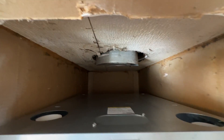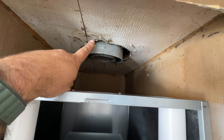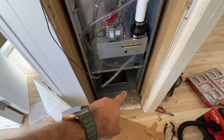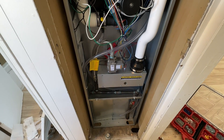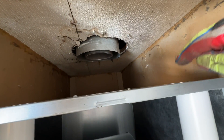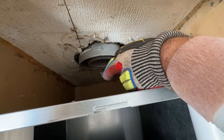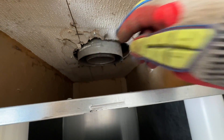This is the space we have to work with. We're going to do an immediate 90-degree elbow and then another 90 straight out on both the intake and exhaust sides. For the PVC routing up top, the plan is: put a coupler on, 90 over, 90 up, and then send down the pipe from the top and glue it on both sides.